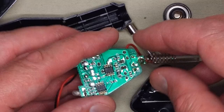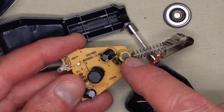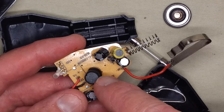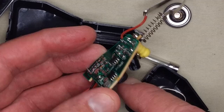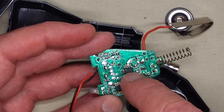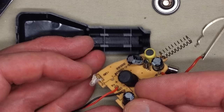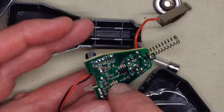It's got some input filtering here, though the picture's going all jerky again — the Moto G4 is playing up. Something rotten at the moment; that's since they did an update and suddenly everything's not working. So you've got some filtering here, then a large inductor, and this is an XL Semi — I think it's an XL4001E. Quite hard to read. And then this is just an LM358 again, a dual op-amp, which is purely doing the LED to indicate when it's fully charged. This thing is supposed to handle 12 to 24 volts.